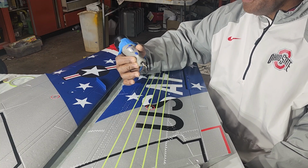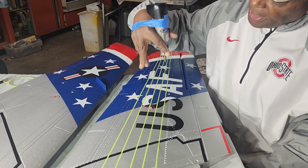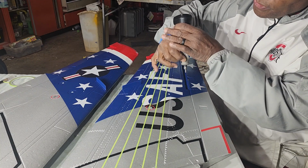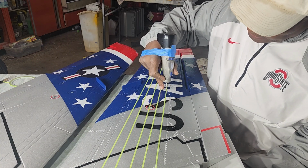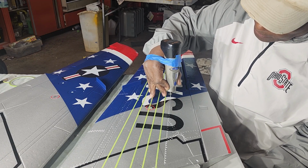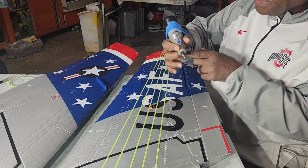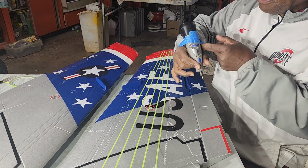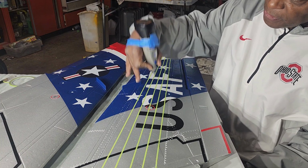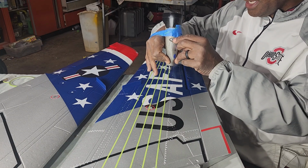So I'm using this like a drill press. I can lightly hold it, and I'm basically just dropping my arm down. I tend to use my finger as a guide when I've got this on. One of my fingers is like here, and I'm just dropping it in the hole. So that's how I'm doing that. You get in a grip where you feel like it's been moving a little bit, because I've been taking some breaks. The big thing you want to make sure is that you're going straight up and down and not at an angle. So put my drill bit on high.